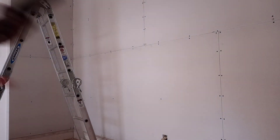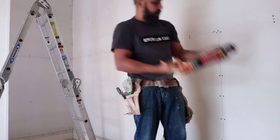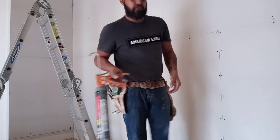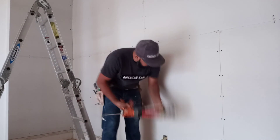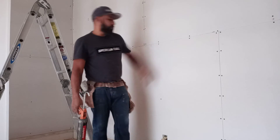So this is how it looks with a quarter inch drywall over plaster, and as you can see it looks pretty good to me. I'm using glue and I'm running my glue all the way down — not in bumps like I do on new construction, but all the way down, just like that. And just put a few screws — this will be strong enough to hold the drywall in place.